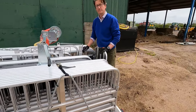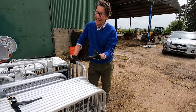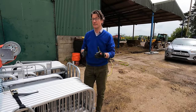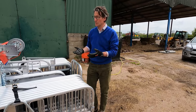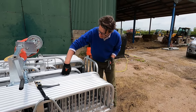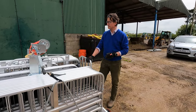It's also simple and well thought out. The thing with making mobile sheep yards is that there's a little bit of a compromise - you've got to keep things simple because it's easy to make things simple that are strong, and these yards do take a lot of work. The devil is normally in the detail, such as the height of the hurdles or the gap between these panels - that's critical. Even 20mm wider and you'll have sheep breaking their legs if they jump over - it's a very very small measurement.